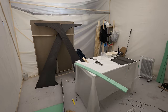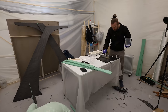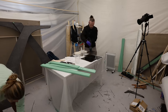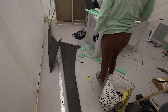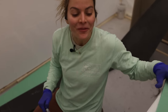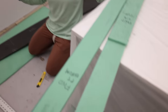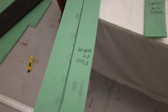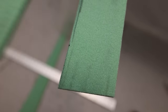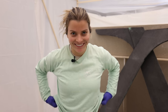Remember how I said there were four parts? Well, that is not true. We're making two basically odd-shaped boxes, and there are six sides to these boxes — so we have four of twelve. Right now Jade is making the forward parts of these leg boxes, parts five and six. The front of the legs is just a straight line, but they do have the curve from the form — and that's where Jade miscalculated on her first cut. The curves are perfect opposites, meaning you could take the forward starboard and make it a forward port. We nailed it with our form. It looks perfect — just a Sharpie line, nothing wrong.